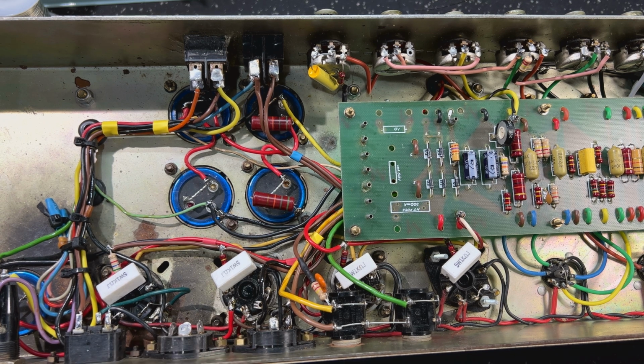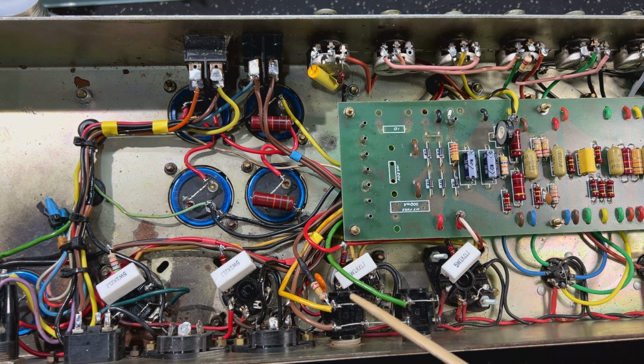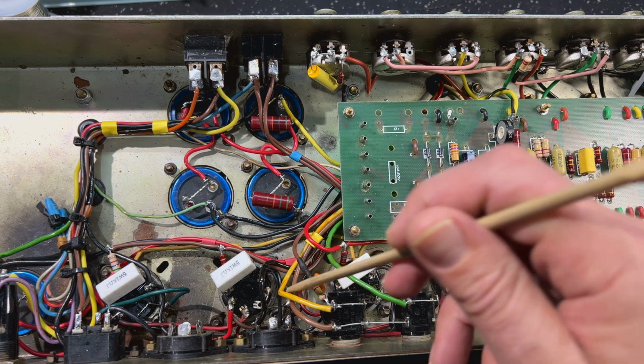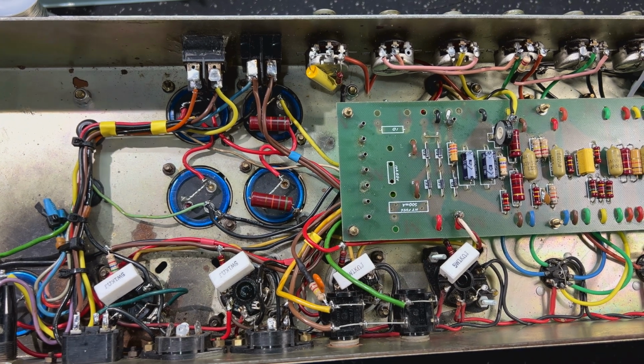So what Troy wanted me to do was to set up these two jacks. One is 8 ohms, which is the one closest to the impedance selector. I will label it, Troy, but now that we're looking at the amp, you can go back and reference this, mate. This is the 8 ohm tap, closest to the impedance selector, and furthest away this is 16, and so I've just hardwired the output transformer secondaries onto there, so no 4 ohm speaker jack is needed.